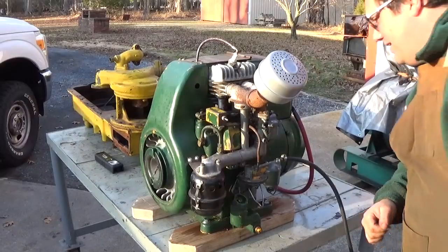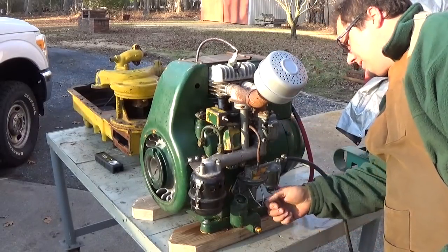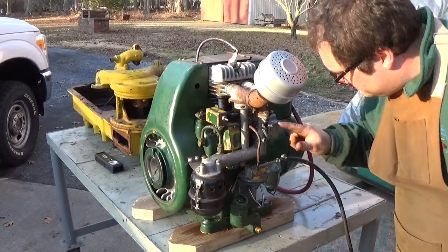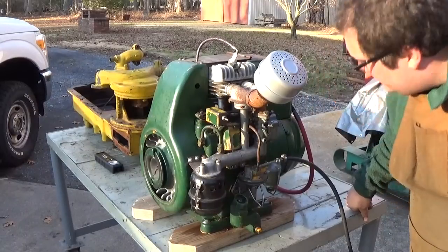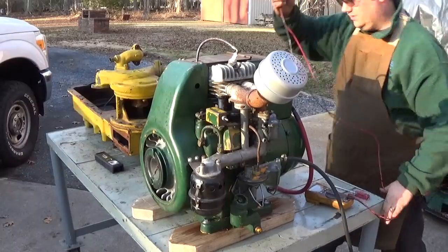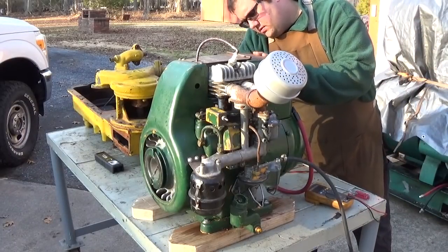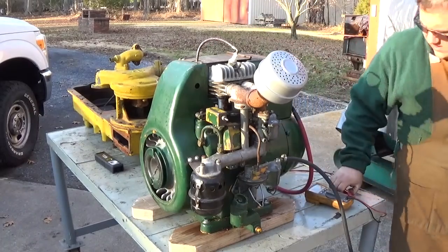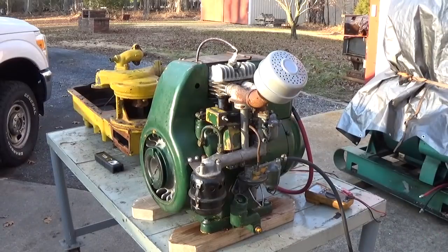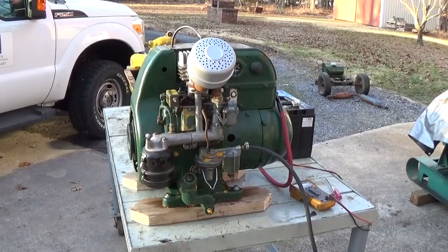Now, I'm curious to see where this thing starts leaking fuel at. I'm sure it's going to seep a little bit. Not the end of the world. Let me get a meter put in here. Okay. You know what? I see one thing I missed. Cotter pin for the throttle linkage. Give me a sec. Okay, here we go. First start. Let's see what she does.